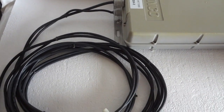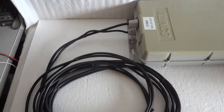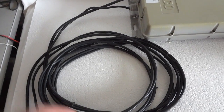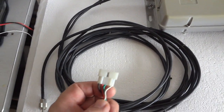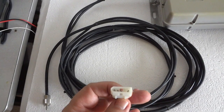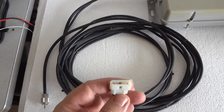The tuner comes with a coax cable and a control cable that is factory original — that's the way they sold them. The 50 ohm coax cable is 15 feet. The control cable carries the supply voltage minus and plus. The white cable is the tune start; you just pull it to ground with a little switch and it will start to tune.